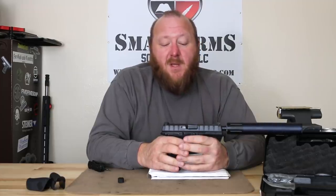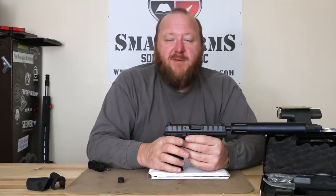SIG did that with their pistol. The P320 M17 is slightly different from the M17 commemorative, which is the actual military pistol. When you look at the underbelly of the slides, you can clearly see material machined out of the P320 M17 slide, and it has a lighter recoil spring — you can feel the difference when you pull it back. Those modifications were made so the P320 M17 would work with all commercial ammunition. With the standard M17, you can have short stroking with lighter-powered ammunition.